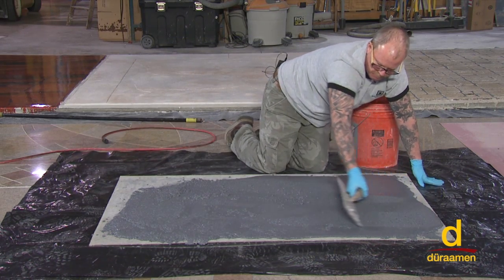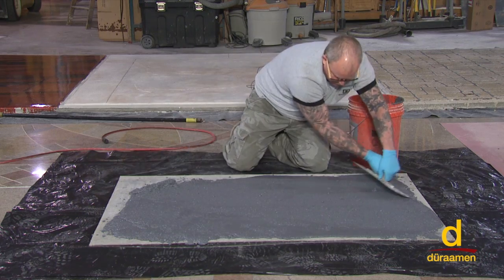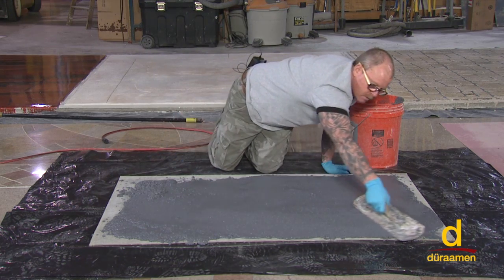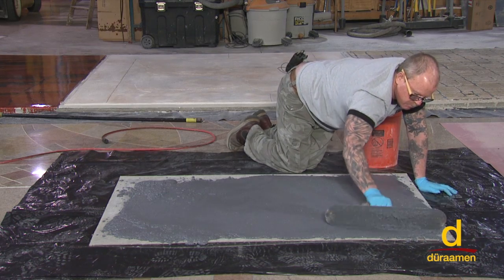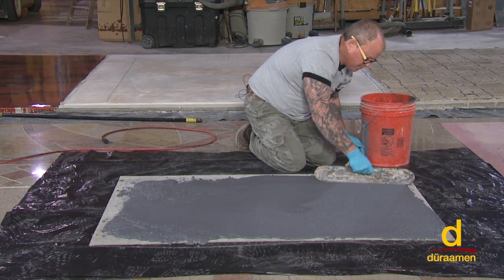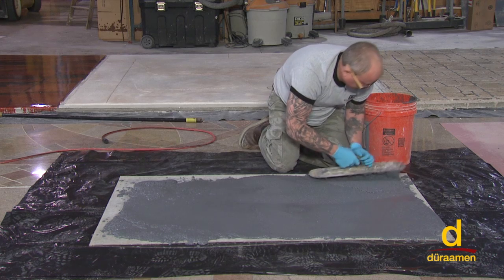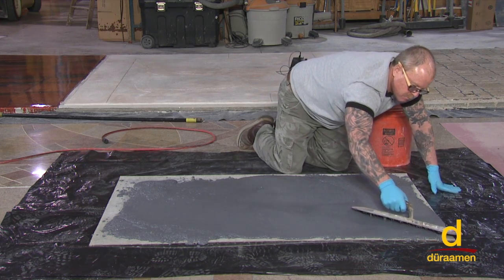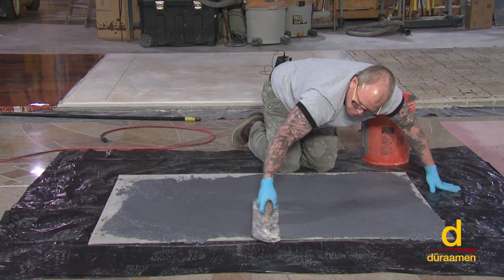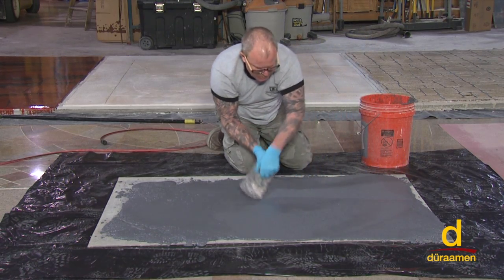It's still just a little bit on the thick side over here. Despite looking ultra thick, it actually has some healing and leveling properties to it. I'm just working quickly to get the material dispensed out onto the board. It's a good idea to have a margin trowel and some solvent with you — you want to keep your trowel clean.